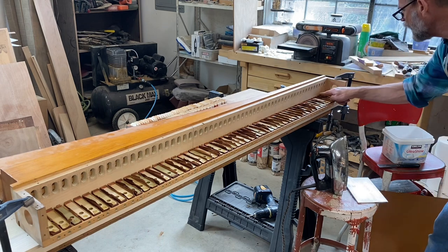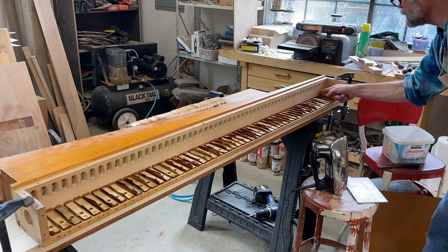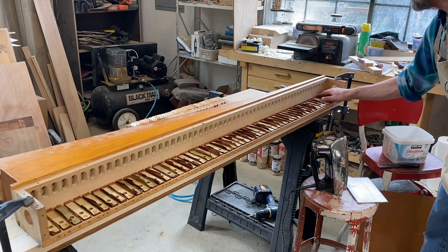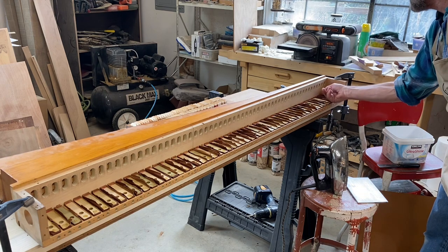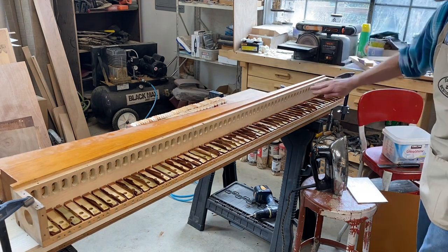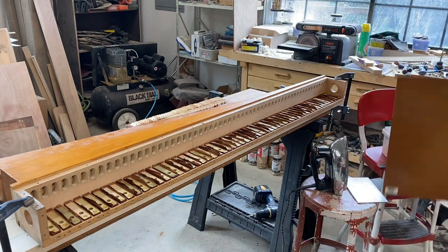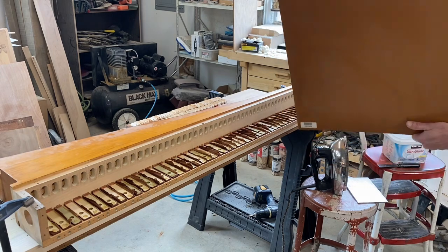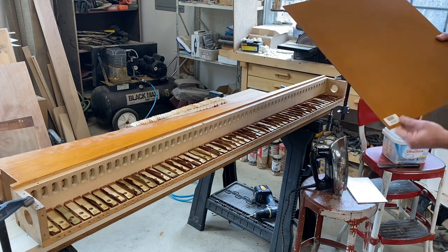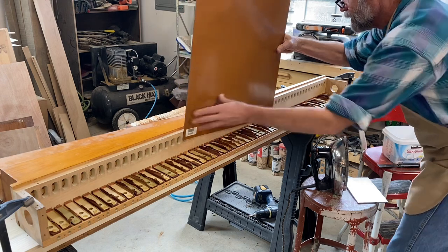It's about a quarter of an inch thick on one end and an eighth of an inch thick on the other, and here you can actually see the glue joint where two pieces of wood were glued together. If I left this board unprotected and allowed steam to contact it, this glue joint would open up. Fortunately I have a piece of 1/16 inch thick phenolic which not only stops the steam from getting through but also helps keep the heat out — and it's just the right size to work in behind the pneumatics.